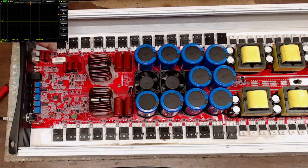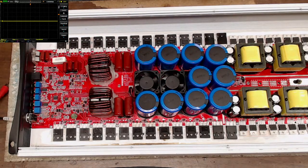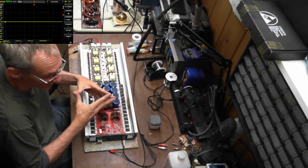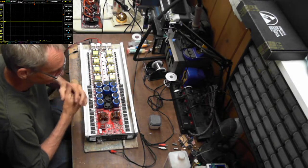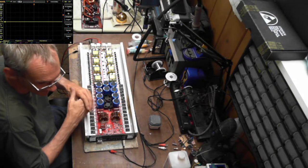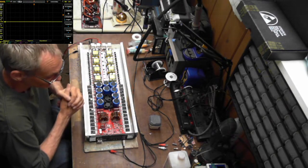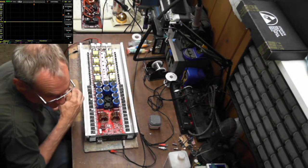All right. So the blinking LED on these. I was working on some sound digital boards that I at first thought had a bad MCU, a bad chip, because it would just blink on my 10 amp current limited power supply. Well, come to find out that these are boards you have to pulse the remote. You have to get that rail voltage to build up to a point where the MCU determines it has enough voltage to go ahead and start up. I'm not quite ready to pulse this yet to get full rail voltage, obviously because I don't have the drive ICs installed.